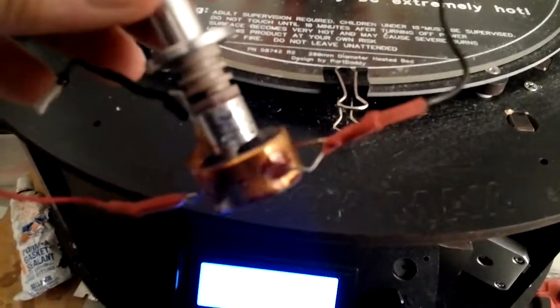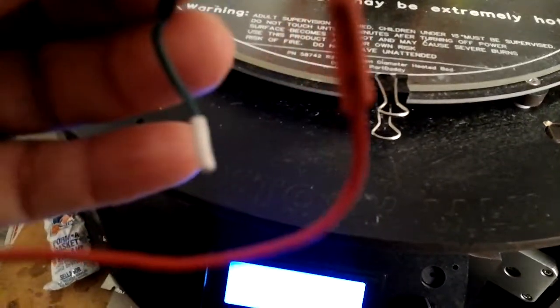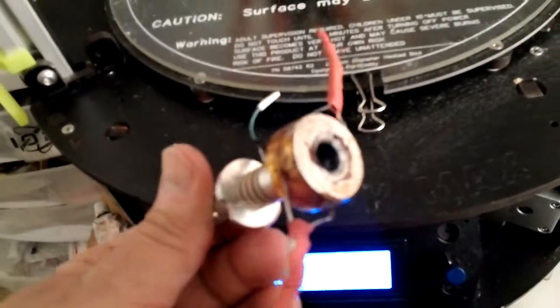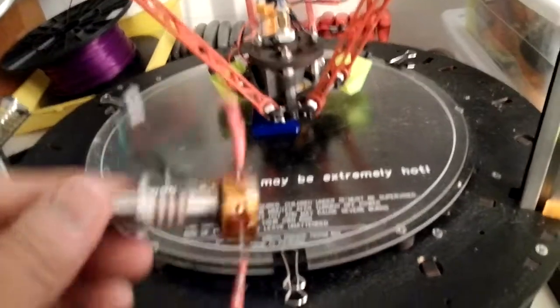Other than my hot end issues — I had this one I redid recently. I bought a new thermistor also from Maker Farm and that's running in there too. It's 100k. I had some problems with this one leaking out and not getting the correct temps. But I'm not going to run those resistors anymore — that's for sure. These 12-volt cartridges are the way to go now.